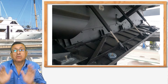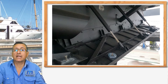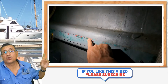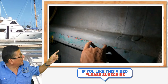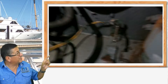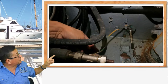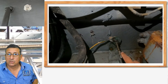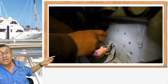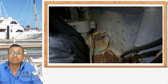I said, 'I hope you solved your problem — can I see your boat internally?' They allowed me to visit. I found that the main bonding conductor on the starboard side was completely corroded — that green color is corrosion. Additionally, the connection between the bonding conductor and the ball was broken. On the port side it is in great condition, but on the starboard side the cable is broken and not connected with the ball. And of course, the sacrificial anode outside is doing nothing — it's decorative.